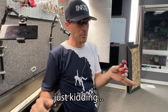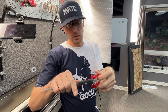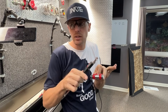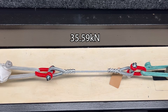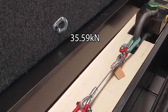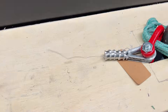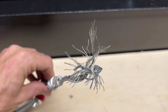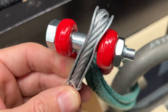Most steel carabiners do not like to go above 30 kilonewtons, so we use chain shackles. The pin inside is about 12 millimeters, which is close enough to a carabiner — so we're comparing the right diameter in these thimbles. Heavy duty thimbles, poor swaging on one side, and the cable is short. That's almost the same result — it did what Dyneema does, with one random strand sticking out. Pretty much broke in the cable; it didn't come out. This heavy duty thimble is also crushed.